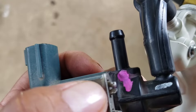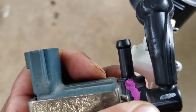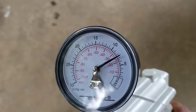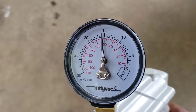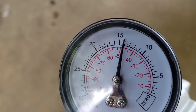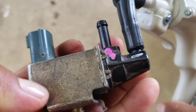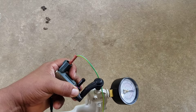It's halfway back together — not completely done. I need to do my test before I put it back together completely. With the vacuum applied, if I put the pressure over here it's slowly leaking — it's going to 15 because I'm just holding it with my hand, and if I let go it loses a bit. The reason I haven't put it fully back together yet is because I want to change the little o-ring inside here, and hopefully that will help.